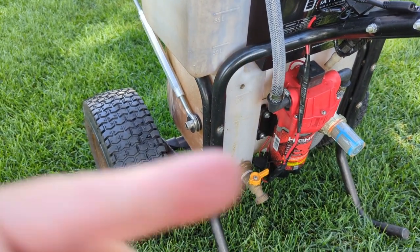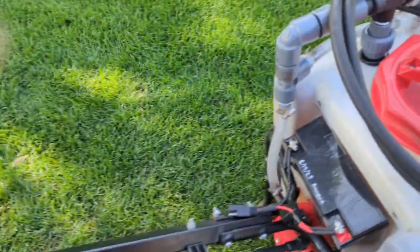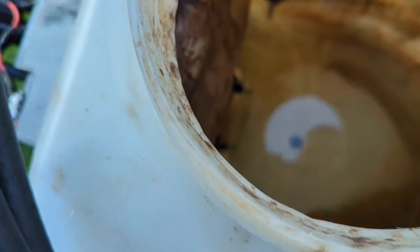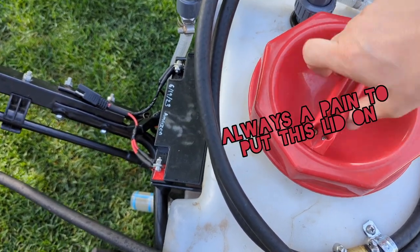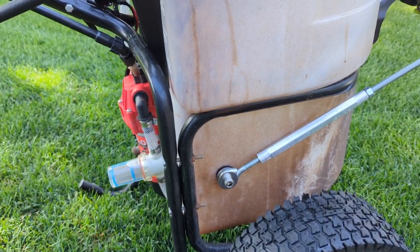I use well nuts here and there — you drill straight through the tank, put the rubber nut in, and as you tighten down the bolt it pulls the rubber nut to seal against the tank. If you look down here you can see how that rubber nut is sucked in; these others didn't move as much but you can see they kind of swelled up. That's how it stops leaking. I had this tank filled up for the last 12 hours sitting in the garage.